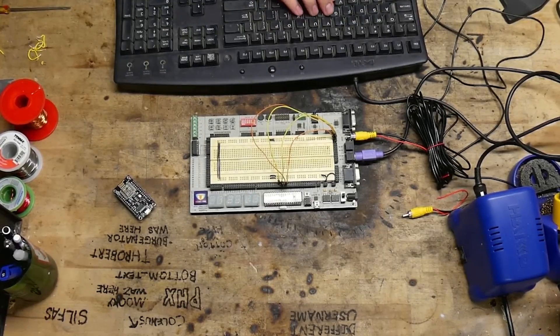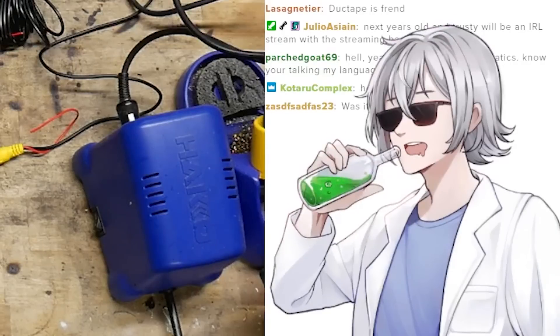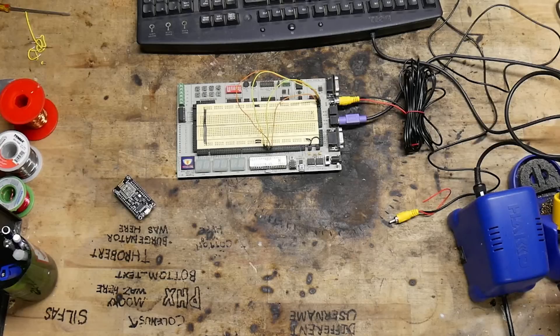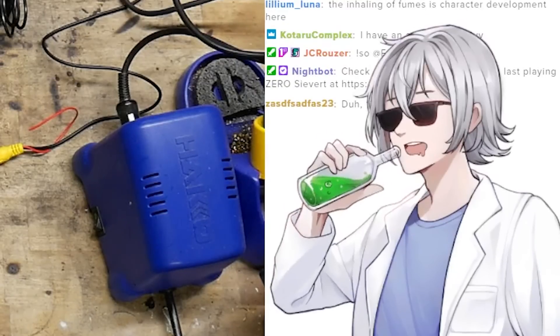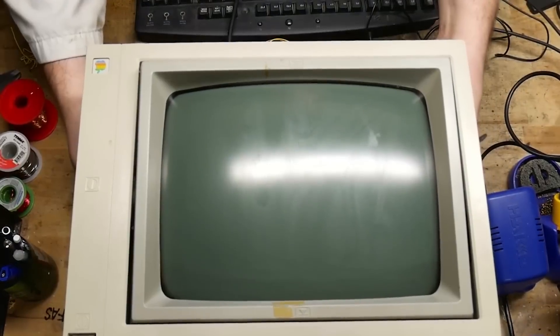These are the mushiest keys ever. I wish I could use a nicer keyboard. Let me see if I can find demos. Let's do demo input — keyboard demo. Here we go: display.tv.terminal. They've changed things since I last messed with this thing. This should just print. Pin 26 is data, 27 is clock. Let's go ahead and wire those up. I want to see if this display is gonna work when it's tilted upward so you guys can see it while I test.